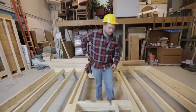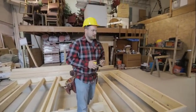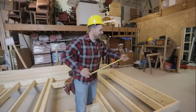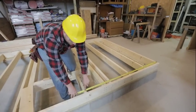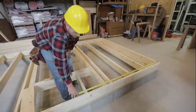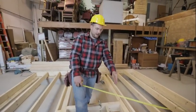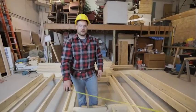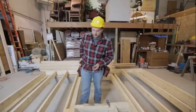If we hook on the end here, we're still on our 16-on-center layout. That's really important when we're putting down our floor sheathing. If we have a seam that lands right where one of these cripple joists are, we still have a good nailing surface to nail that sheathing.